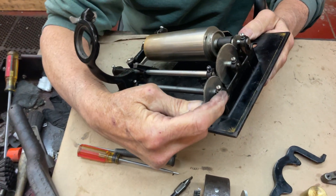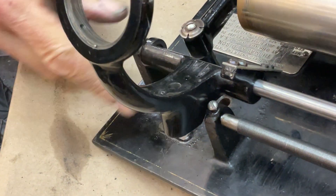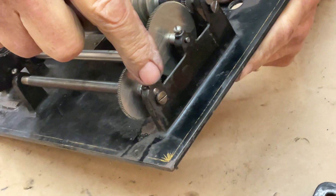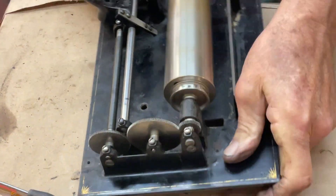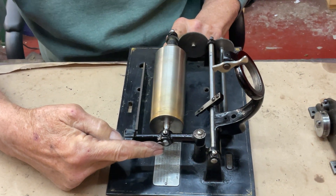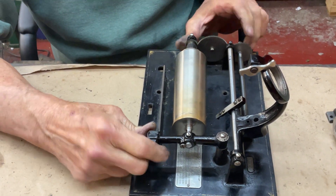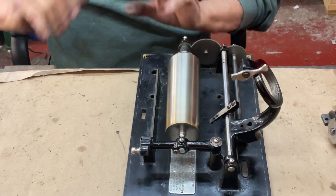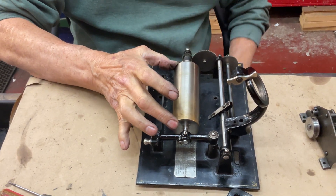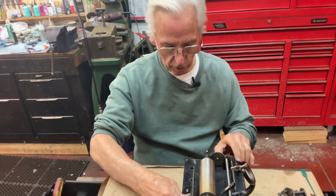On Edison's you have this screw right here, and on the lead screw there's one at each end. What this does is it gives you the tension of the bearing. Each end of the mandrel bearing has the same thing — you have a screw that holds it in place, you have the bearing, and you have this tensioner. To get it to run just like that, running very freely with just a little bit of play, and I have the same little bit of play back in here to get everything to run smoothly.